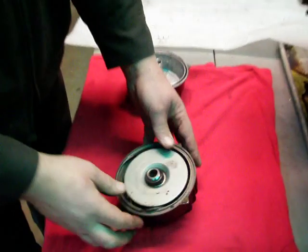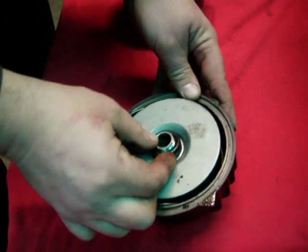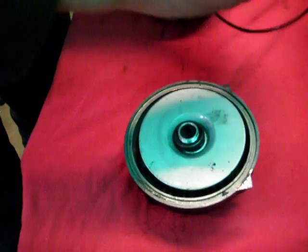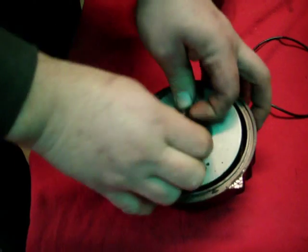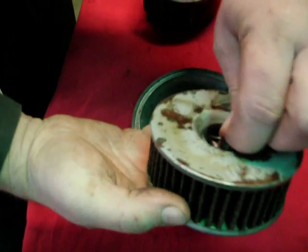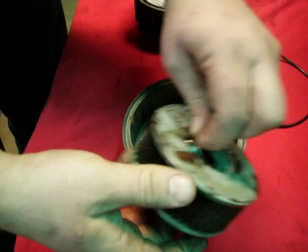Here's what you look like when you get one of these off that's been put together incorrectly. Notice the seal is displaced. Don't worry about the O-ring there. We'll pull this apart — you can see the seal's all mashed, and the spring's actually pushed into the filter.